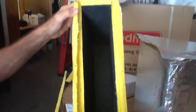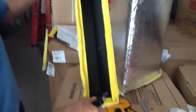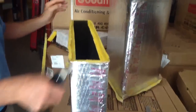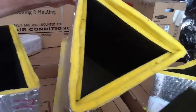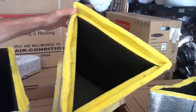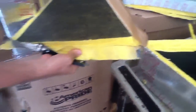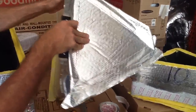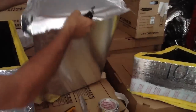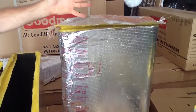So you get the point here guys. This shiplap tool is to make a groove inside your ductwork, so I can take another piece of ductwork — maybe like this right here — see how that's got the groove all built inside of it. This just happens to be a triangle. Same principle, whether it's a rectangular box or a triangle, you take your ductwork, you lay it inside here, and you have a good solid base.